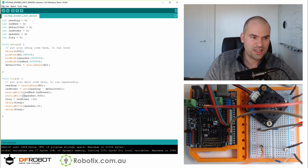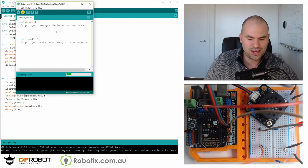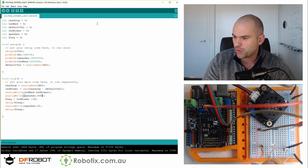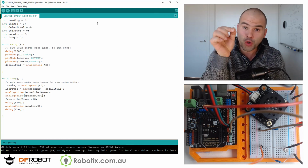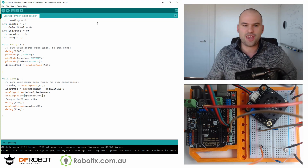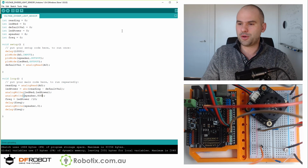Okay, that's all the experimentation I'm going to do. I suggest you make this your own, you build it, and that you have fun with it. Try both the LDR and the photodiode. They give slightly different effects. The photodiode is a lot more precise, has a lot more range, but somehow in this experiment, the LDR, I think, gave us a slightly smoother sound. So there you have it. See you in the next tutorial.